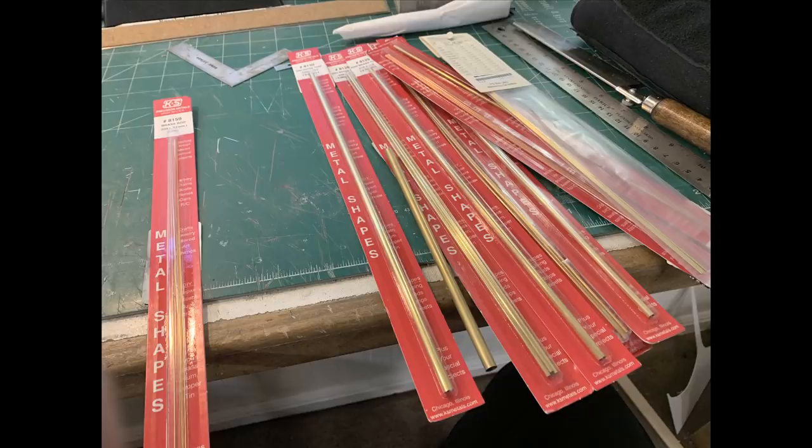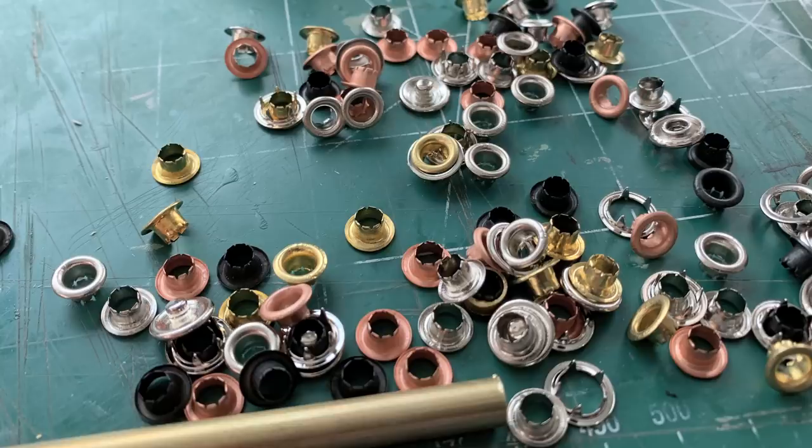It's going to be built mostly out of these K&S brass shapes. We use this for a lot of things. They come in handy. And they telescope inside each other. They're brass tubes and then wires, and the brass tubes will telescope inside of each other. Then you can solder this whole thing together because it's brass. It forms easy. It's really fun and easy to work with. And then we're going to be using...